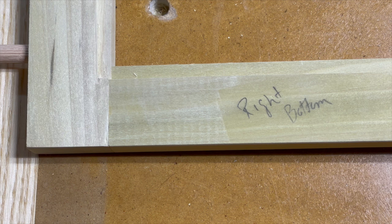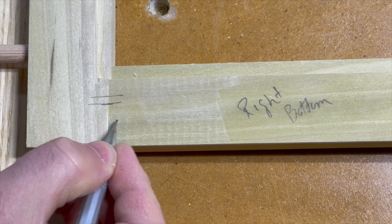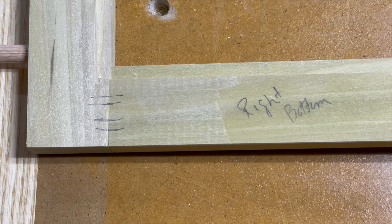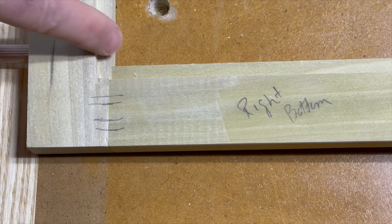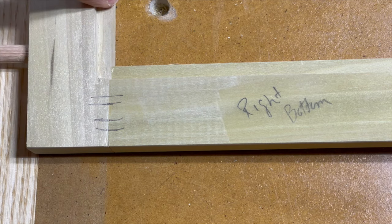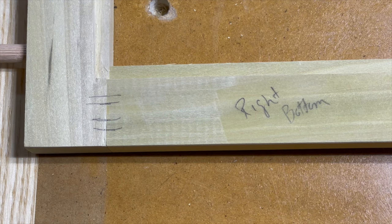When making my frames, I made the decision to push two dowel pins to one side. I put my dowel pins approximately here, primarily because I had to cut a rabbet on the inside of this board and didn't want to cut into the dowel pins. This rabbet is going to house a panel on the sides and the back of this hallway table. It may not have been the end of the world, but I figured why risk it?